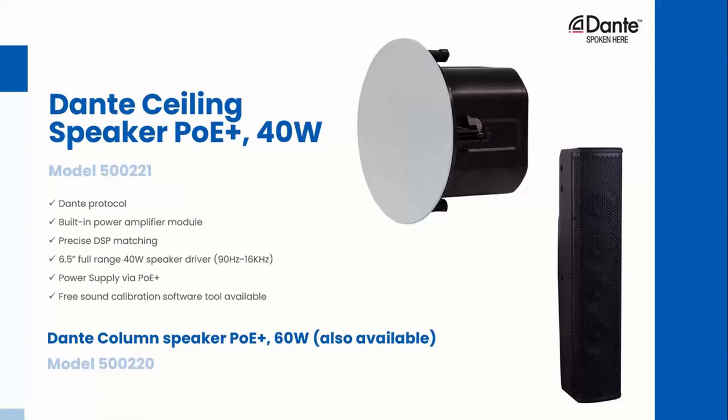We have a similar product that's column mount. It's the one at the bottom of the screen. This device also supports PoE+ for power, but it is a 60-watt speaker system, so it has a 60-watt integrated amp. And this device also has 4 drivers inside the unit, and they're 3-inch drivers each. Again, it's a full-range speaker system.